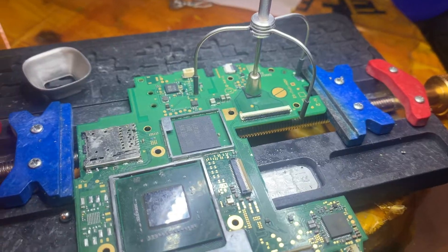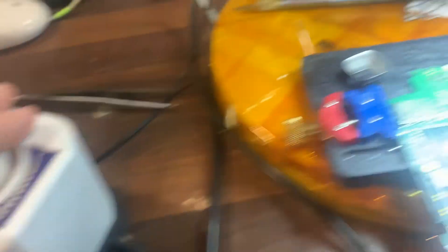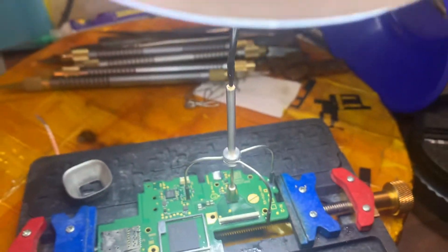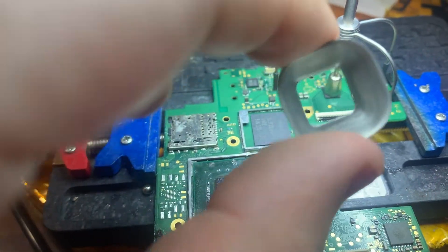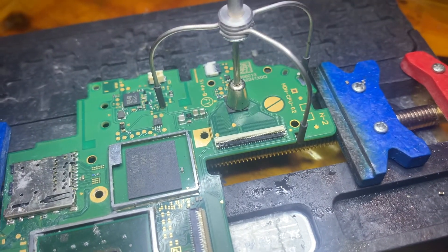Let's get this set up. You push it down, and then the suction — as you can see, covering the outlet causes more suction. I have that on maximum. As you can see, the suction cup is attached to the IC. All you do is push down and it'll attach itself to the IC. Obviously you'd have a heat shield on it normally, but for demonstration purposes I'll show you it without the heat shield.